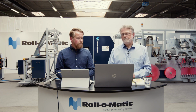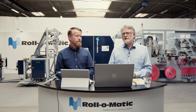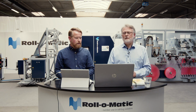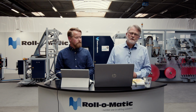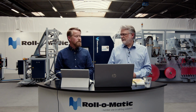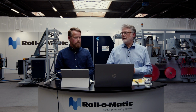And then the question is, what is the best material for these labels? And you just mentioned that it's gum paper. Yes, it is. It has to be a gum paper used for this purpose. And of course, you can buy gum paper in many different thicknesses. We normally recommend around 70 grams per square meter as the quality. But there could also be different demands for the glue depending on how quick you want it to stick, etc.